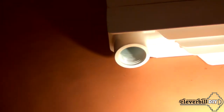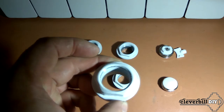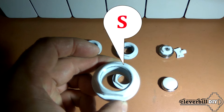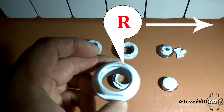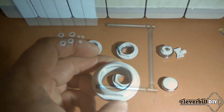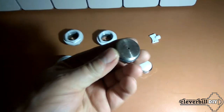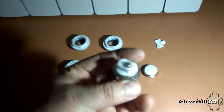To connect a new radiator to the heating pipes, you must have a so-called connecting set. The set consists of four connectors, where two have an external left thread and the other two have a right thread. For convenience, on some connectors, adapters have a designation where S means the part is installed on the left side of the radiator and R means it should be on the right side. The internal thread of the connector can be different, and the choice of connection size depends on the diameter of the pipes. The set is also completed with one plug and a Majewski tap with a key.